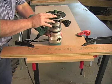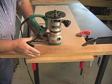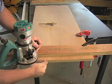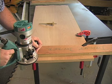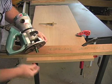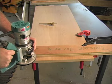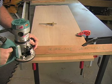The setup of the router is rather important. This is a three-quarter inch pattern bit — the bearing rolls right along the fence edge, and wherever the fence is, the piece cuts. The setup is made to cut a quarter inch down into the material; by cutting on both sides we leave a quarter inch tongue in the center with three-quarter inch material. Because the pattern bit is three-quarters of an inch wide, it will not cut the entire width of the tenon in one pass. So the operation is to start at the far end, climb cut as we come back removing about a half inch of material, and then finish with a normal routing pass all the way through to finish one half of the breadboard.